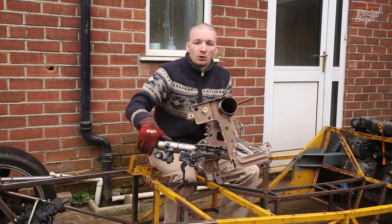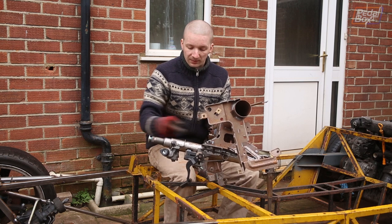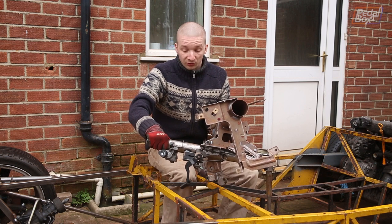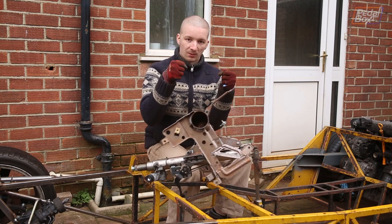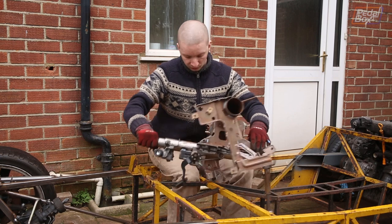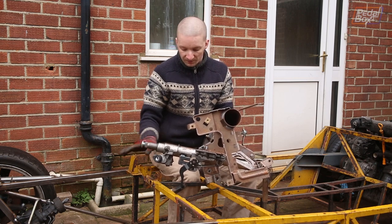This is the full dashboard mount and crossmember out of the A3 that we've pulled all this stuff from, and this is the vertical adjustment on the steering column that we'd really like to keep. It also has some in and out adjustment. Now Adrian and I are very different sized people, and we need to be able to handle the fact that our arms reach different distances when we're in the car, so the wheel needs to be able to move. We're going to have to keep a lot of this old bracketry — there's a pivot point at the back that it rotates around for the vertical, and it slides internally — so we're going to lop off the rest and reuse it, attaching it onto our body.